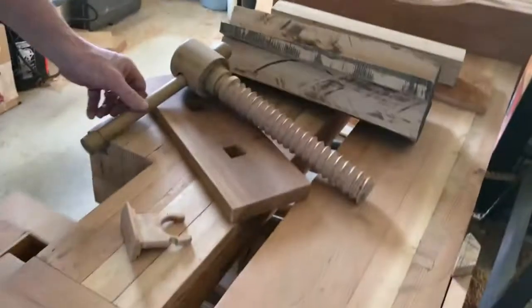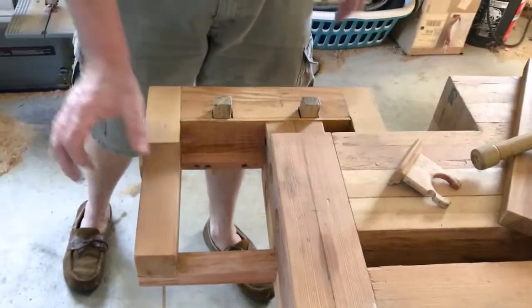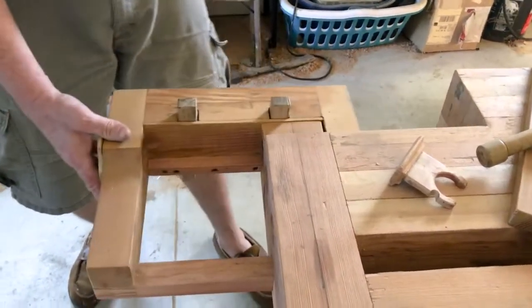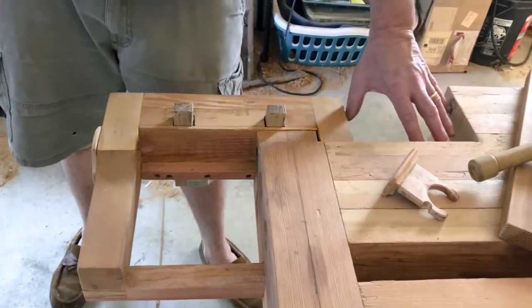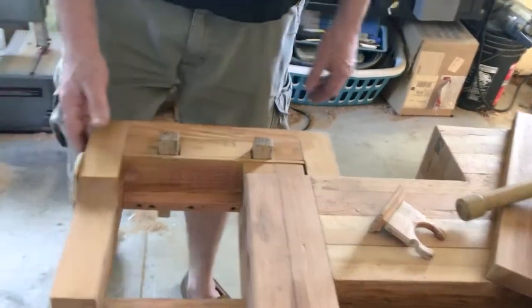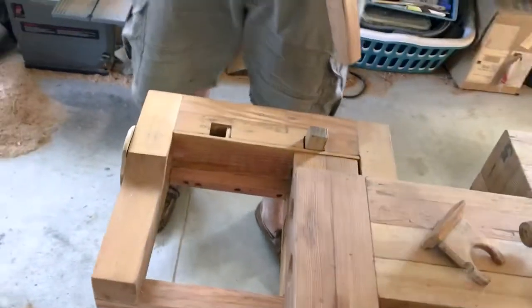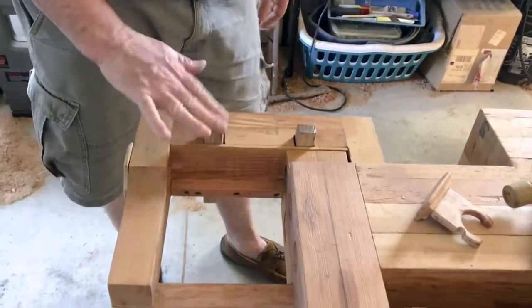You can see how the vise slides. Some other videos show jaws laminated from a couple of pieces together. This was actually two and a quarter inches thick and I felt it was enough. The negative of having jaws laminated from two pieces is it takes away from the clamping range of the vise. This is plenty sturdy as is. I have two bench dogs in there, all made out of eucalyptus, and there's a little wedge right here that holds each dog in place at any height you want.